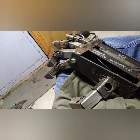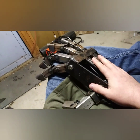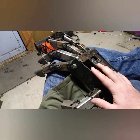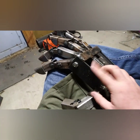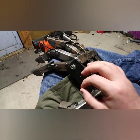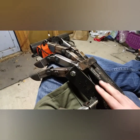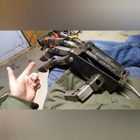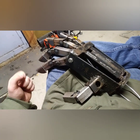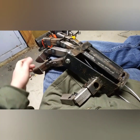This is a version one hand created over a year ago, supposed to be the exterior frame of the power armor. It quickly became outdated because all the servos and linear actuators I was using were too big to fit inside it. If you're doing something like this, make sure you do the electronics first — the frame, welding, and all that can come after once you have all the dimensions. In the Fallout universe, the power armor was created as a walking tank, and no matter how much I try to compact this, at some point we have to accept it's going to be a monster.